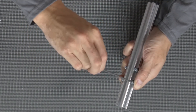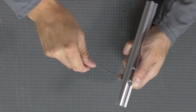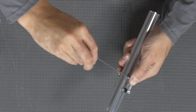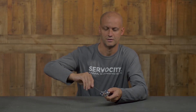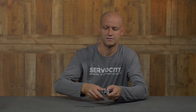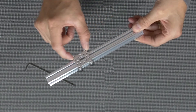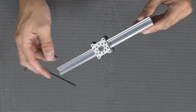Next, what we want to do is squeeze the opposing wheels together just like this, and we're going to go ahead and tighten these down. We're going to do that for both pairs — this way it gets a nice firm mesh onto the x-rail. As you can see, it easily slides back and forth, and now you're ready for mounting additional x-rail. If you have any questions at all, please shoot us an email and we'll be back to show you some other helpful tips.